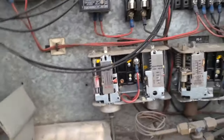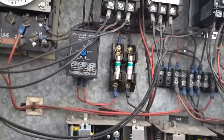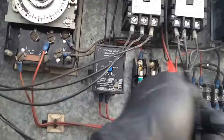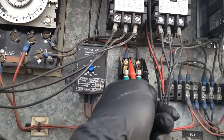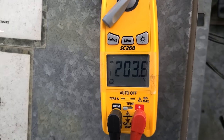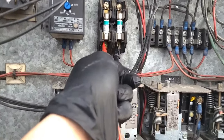Then, before, or whatever, it doesn't matter. You still gotta check all these things — fuses. You've got incoming fuses that have incoming power, which are coming in to the top, right here. So we should have 208 right there — 203, whatever, same thing. And we should also have it right there. And we do.